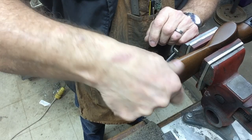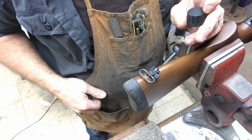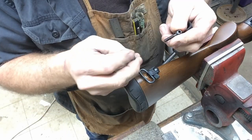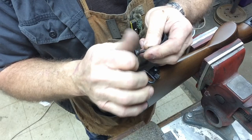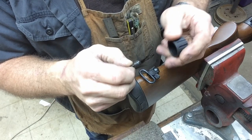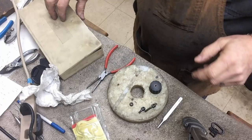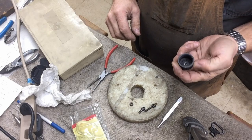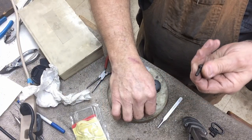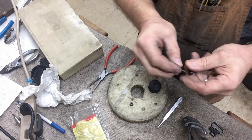There's our rear stud installed — goes on just like that. Now I'll take this over, set it up in the lathe, and drill the magazine cap. We're going to take our threaded machine screw — I may use one out of my own kit instead of the one in the kit — and we actually put the nut on the inside, lock it in place, and then stake the outside so it can't move, because we want that to rotate in the magazine cap. We've got our end cap drilled and deburred on both sides, and I'm swapping out the stud that came in the kit with a half-inch stud that I shortened up just a little bit more.